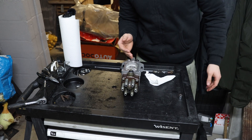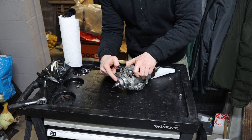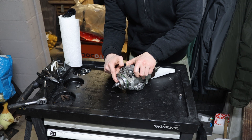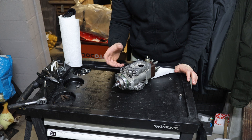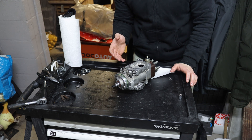Another thing I forgot to say is you really need to make sure that the dot on the cam plate is aligned with the key at the front. Otherwise your pump is mounted 180 degrees reversed and your engine has no chance of actually starting.